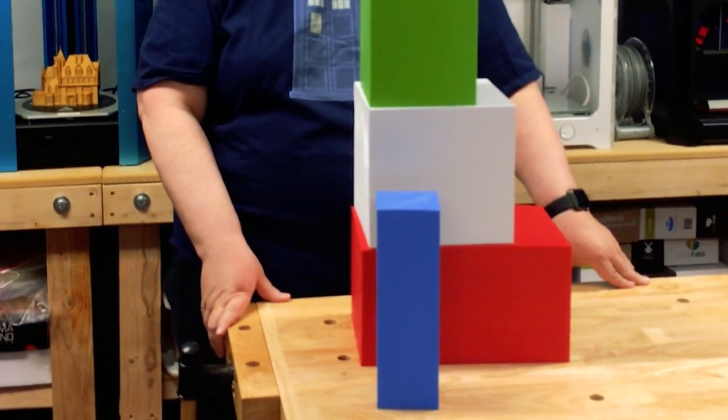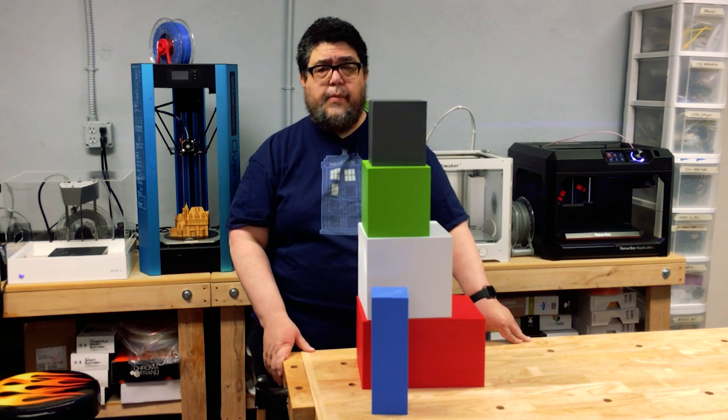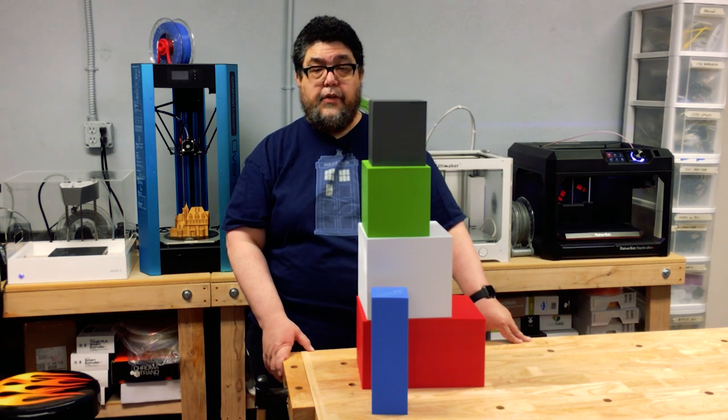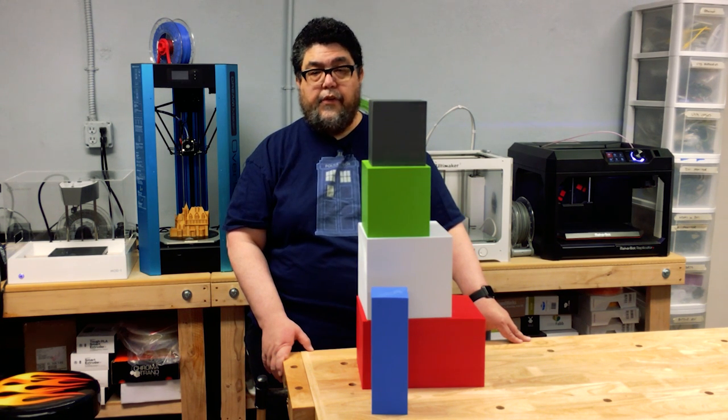So now that you've seen the results of my little study, what does it all mean? First, don't freak out too much about the fact that specified maximum build dimensions and the actual ones are slightly different. In most cases, the difference is a centimeter or less. That said, if you're buying a 3D printer for a project that has a tightly dependent size, you should factor into your decision that the build area documented in the specs is likely to be optimistic by about 5 to 10%. If you're particularly dependent on an exact size, ask the vendor to print a parts sample to see what the machine will actually produce.